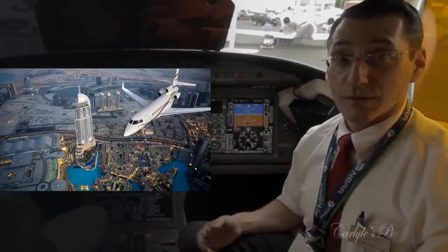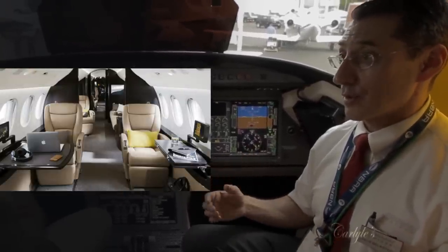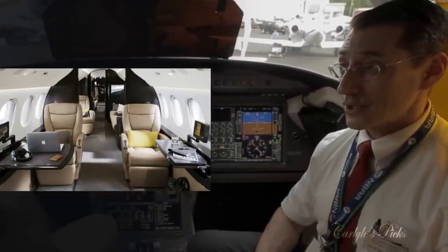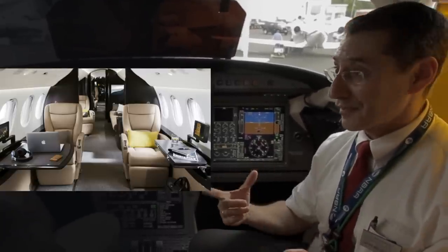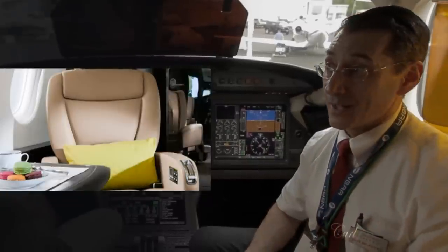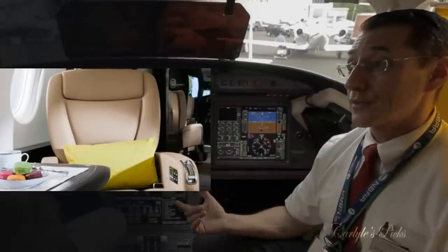The aircraft has been flown 12 hours and 25 minutes with comfortable fuel reserves. Its three-engine configuration provides redundancy for safety and performance: with one engine out, you've lost only one-third of your thrust, versus 50% in a twin. That means with two engines still operating, I can carry a larger payload out of high-elevation airports like Aspen — preserving range even on hot, heavy, high-altitude departures.